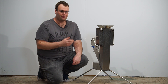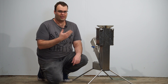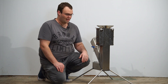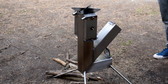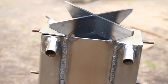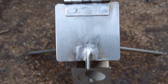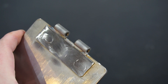So now I'm at the stage where all the metalwork fabrication is complete. Before I move on to installing all the electronics, I first want to light a fire and make sure that the rocket stove performs how I expect. Because I've chosen to make my rocket stove out of stainless steel, I'm expecting to get some really interesting oxidisation colours happening as the fire heats up the stainless steel. The only issue that became evident during that test was the hinges started to bind when they got hot, but nothing a file can't solve.